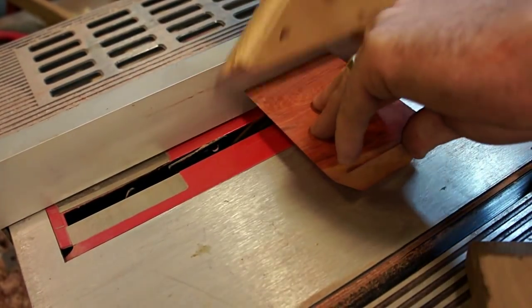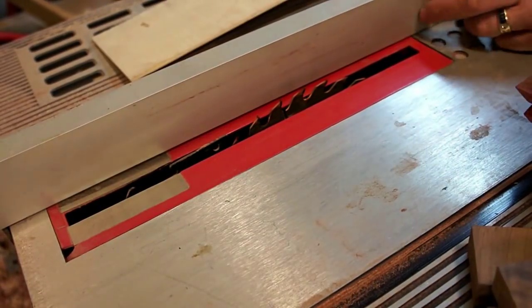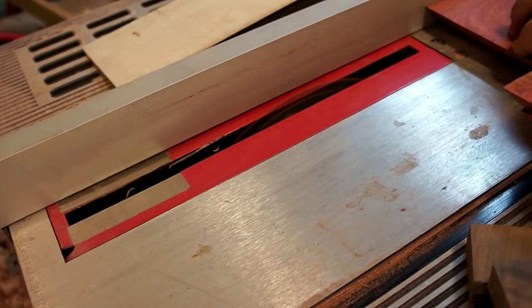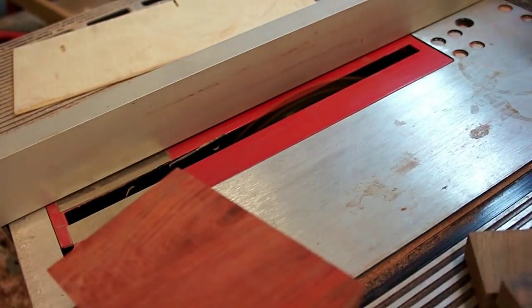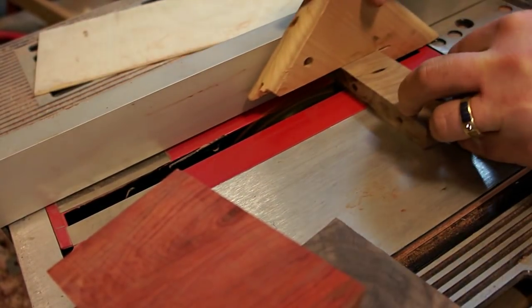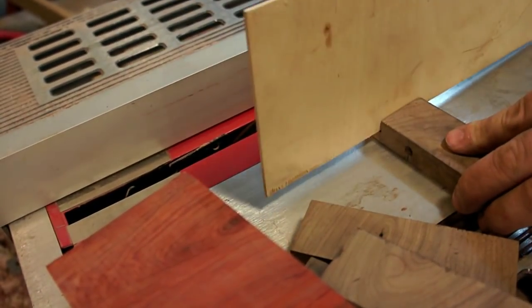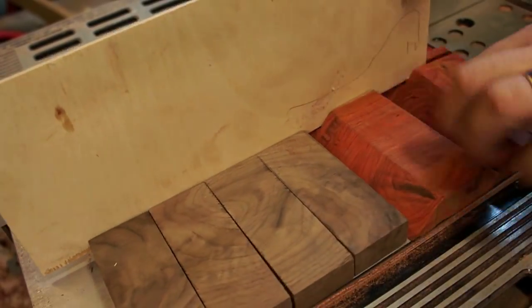For the bottoms I actually used a little bit different technique — I'd never tried this before but I've seen a bunch of people do it and it's really popular. Basically what I'm doing is cutting a slot in every piece. Then I'm moving the fence over a little bit, and after I move it over it gives me just enough width to fit the 1/8-inch Baltic birch plywood inside that slot. After I cut that second pass I had to go through and check just to make sure the fit was right.